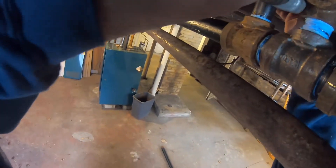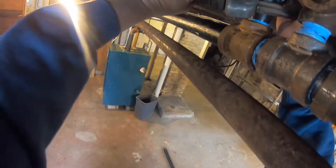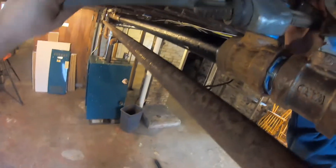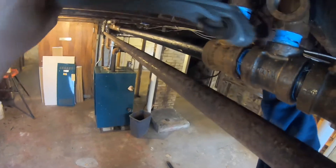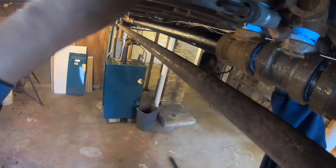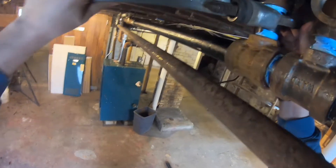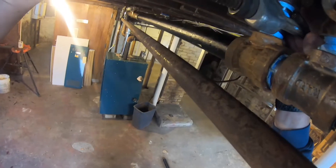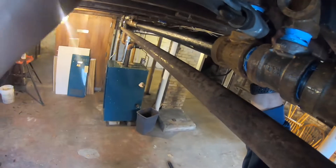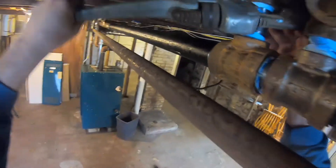Get the jaws caught on the hub, and this is the one that's really close to the floor joist. So as I push it, it's going to make contact with the joist and push it around. As long as you have the movement in the header, this shouldn't be a problem. Had this been a problem, I would have had to put a union in that space in between the T and the 90 to make that 90 face the proper direction.